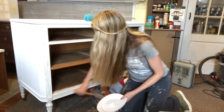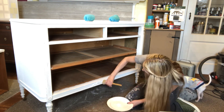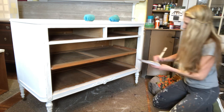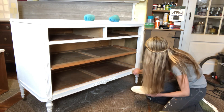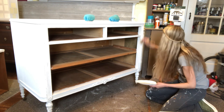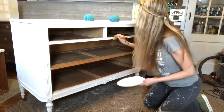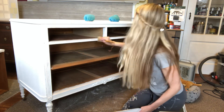I love that look. Go around the whole frame like this. Now I'm coming up to that ornate piece on the bottom of the dresser — I don't want my brush loaded with too much wax or it's going to get stuck in the crevices. I'm loading my brush up now because I'm coming up to a flat spot. I like to work in either back-and-forth or circular motions. Once I'm done here, I'm going to buff the wax off — again, work in small sections when waxing and buffing.